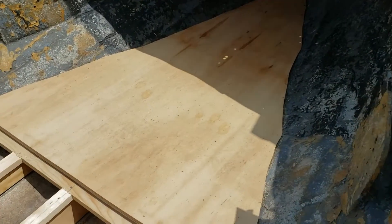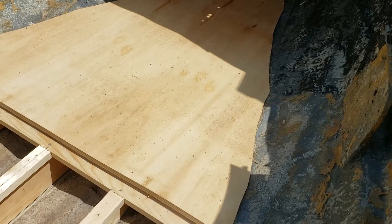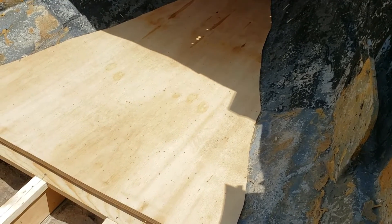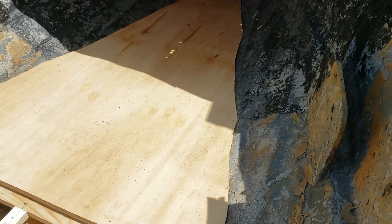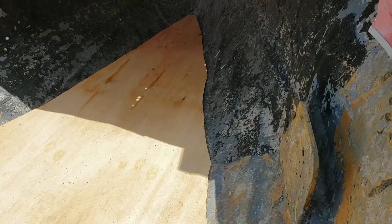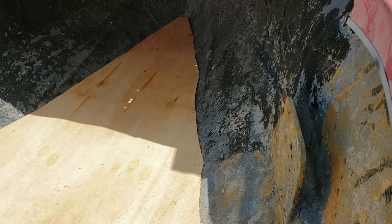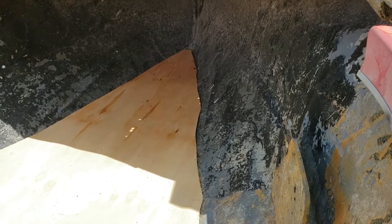Today I'm getting the plywood cut to go into the bottom of the boat. As you can see, I got that first piece cut and got a lot of things figured out there. It fits pretty well — it's down on the actual supports the whole length. It was interesting to sand and work the angles on the other side so it wasn't being held up on the walls. None of the gaps are too heinous; I should be able to fill them with boat filler, and once it gets glassed in place it'll look a lot tighter.